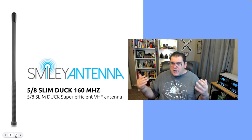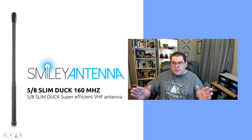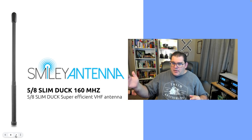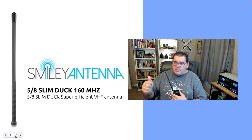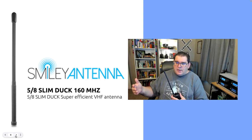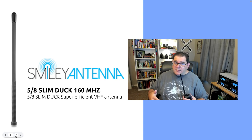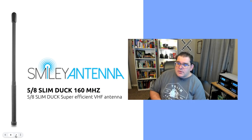Some people ask, well, the scanner comes with an antenna. What's wrong with that one? Well, that antenna is a wideband antenna. It's going to work really okay across the board of all frequencies. It's not going to be a king performer on one particular band versus another. When you get something like this, it's going to work really well on the railroad frequencies, the 160 megahertz, and it's not going to work so great on UHF, I should say. VHF, it's going to work fine. UHF, it's not going to be so great. Maybe on 800, it may not be so hot either. But it may work on those close systems. But it's going to work really well on the railroad band, that 160 megahertz.